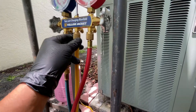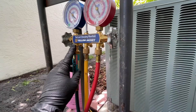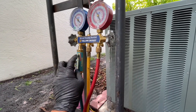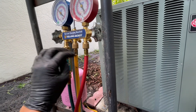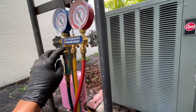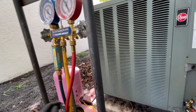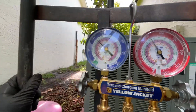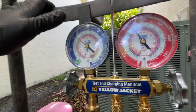The charge comes in right here. You cannot pour all the liquid into your compressor because that will damage it. That's why you have this quick charge - it converts the pressure of the liquid into gas and seeps it into the system as gas.